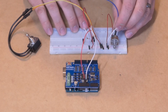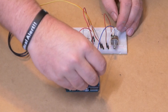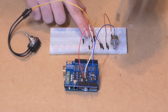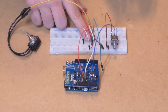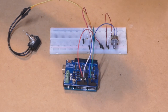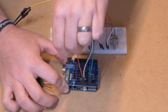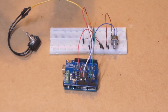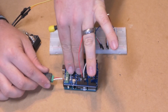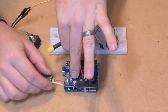Then we connect the end that goes through the resistor to ground. Next we hook up our sensors — we use this blue cable into A0, and then hook our single pole switch sensor with this green wire into A1. The last thing we need to do before programming is attach our power adapter to the DC connections in the motor shield. You may not need to do this depending on your power supply — if you're using the power supply linked in the description, it comes with one of these adapters and you install it as shown.